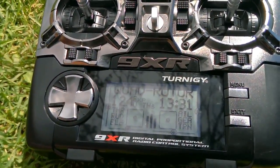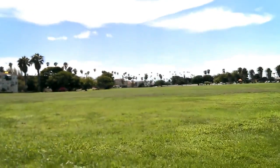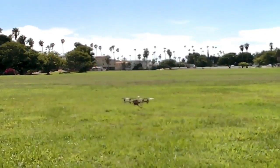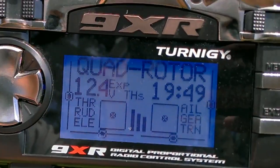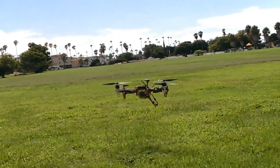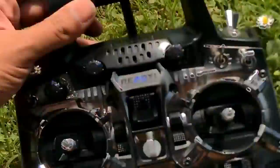At 13.5 minutes — you can't really see the volt meter from here, but it looks like it's about 10.9 or 10.8. Almost 20 minutes now, and the volt meter is bouncing between 10.6 and 10.7 volts. When it gets to about 10.5 or 10.4, I'll go ahead and land it and then check the time.